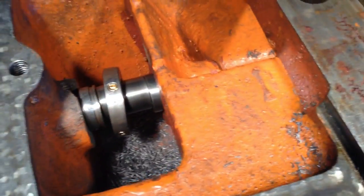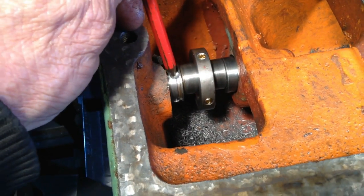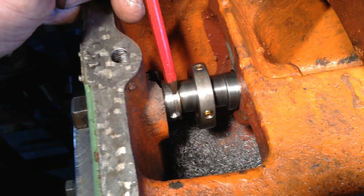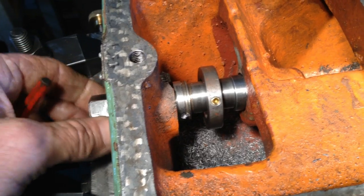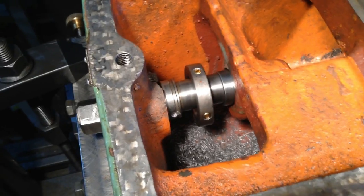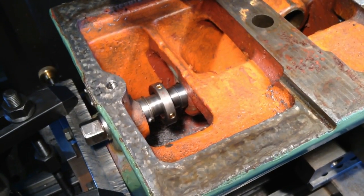And of course, our locking collar, we've dimpled into the shaft there, so it'll lock on the shaft in two positions. And that means we don't need to buggerize around with this circlip anymore, or Jesus rings, as one of my subscribers calls them. It's in a real prick of a spot, that clip. So we've sorted all that out. So this part of the mission is complete, ready for assembly.